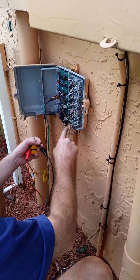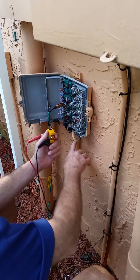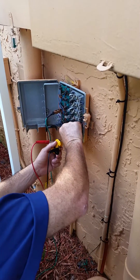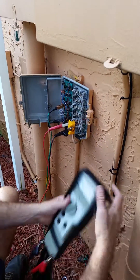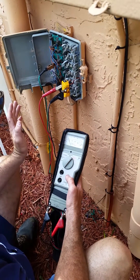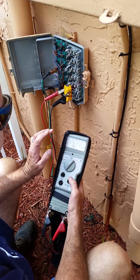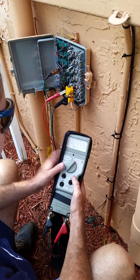It's consistent throughout all these wires going in. Maybe when they were doing stucco at one point they damaged the wires, or they put the screen over the wires and damaged them. This is the one that's from 30507, and it should be on zero down there, around 100 megaohms.